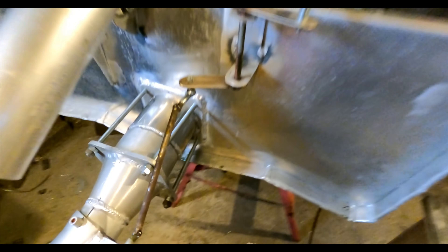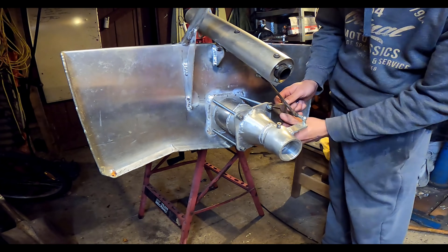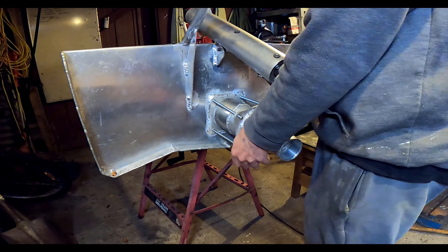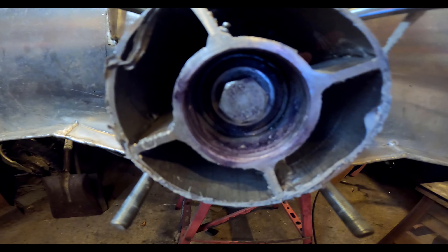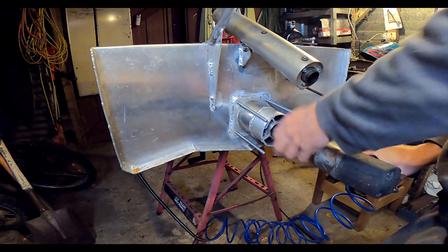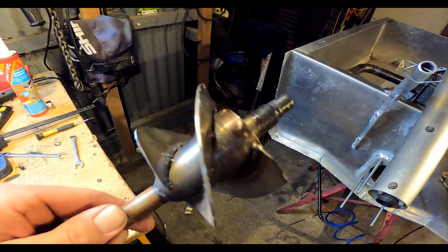After the test drive we're here ready to check the damage and see what's been going on. There was a huge big leak coming out — the jet unit's all twisted. I'm going to take it apart and see what I can do to fix it. There's water in there, so it's getting past the seal, or getting past here. The impeller's been scraping a bit.